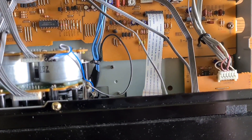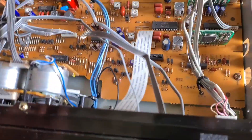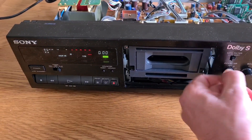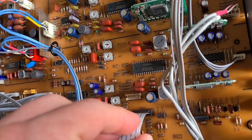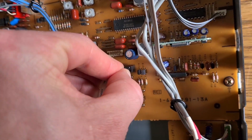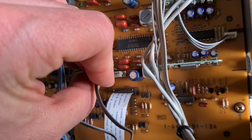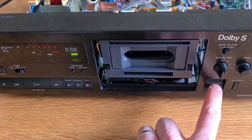It's not the plugs — that's done nothing. So we'll go through my fault-finding here and see what's happening. These are the wires from the eject button board; there is another small one which I'll pull out in a minute, and the ribbon cable is for the display. These all seem pretty good. I don't think he's had this off. We could have an issue with the button. Calibration and monitor buttons obviously aren't doing anything. Just doing a really basic visual check — most of the time with cassette decks you can see something pretty simply with a good look at the start.